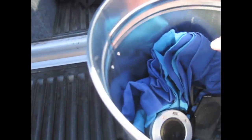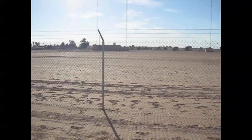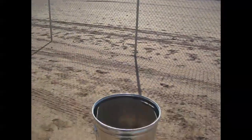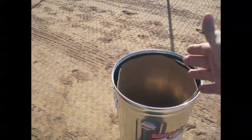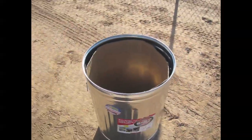As you can see, it makes a good Faraday cage. The double nesting really helps, whether you're using foil inside the big can or foil inside the little can, as long as whatever's inside isn't touching the inside of the Faraday cage. As long as the foil pack isn't touching the inside of this cage, you've got two nested Faraday containers that are dampening out 50,000 watts of AM signal. That's absolutely one of the best things we can do to test, other than an actual EMP generator or 100,000 watts of AM — there are only a few of those in the country. Given the scientific opinion that one single galvanized trash can would be enough, based on these tests, either foil-wrapped devices inside a can or a double-walled container of two cans is going to be really good Faraday protection for your devices against an electromagnetic pulse.